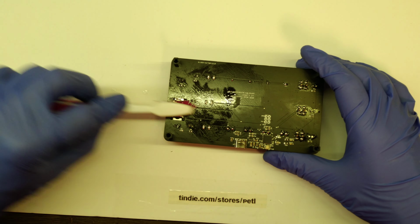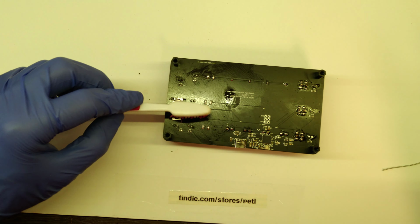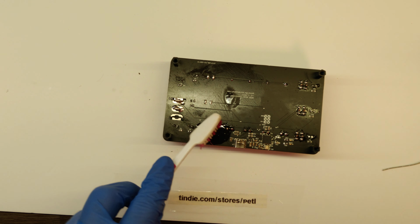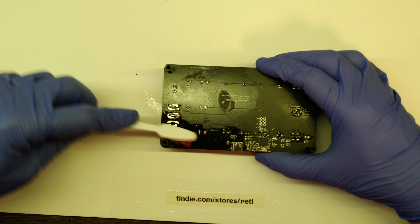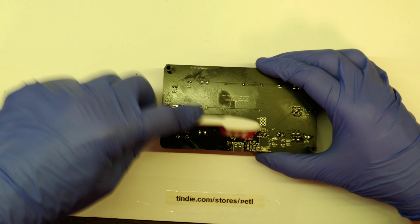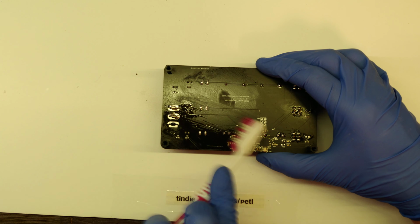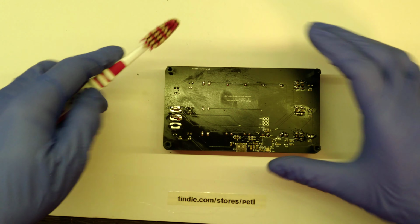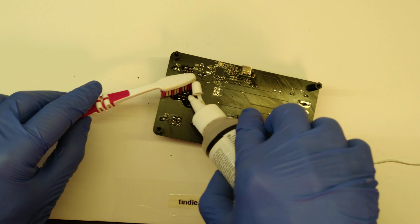If you're an electrical or electronics engineer like I am, you can also take a look at the schematics of this unit. It is quite interesting. The USB input, due to it being USB-C, actually has the correct USB-C power sinking resistors attached, and for the power supply itself, we even have a small ferrite bead to filter stuff, so that in case you have a really bad USB power supply, I'm not sure where you're going to get that from, the unit itself should be quite